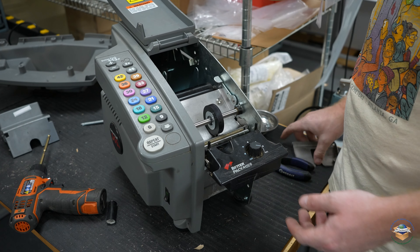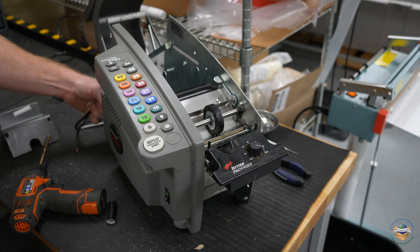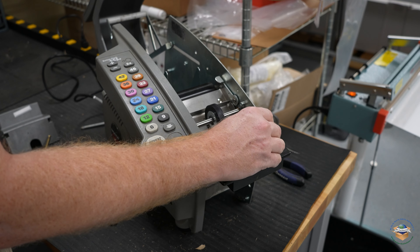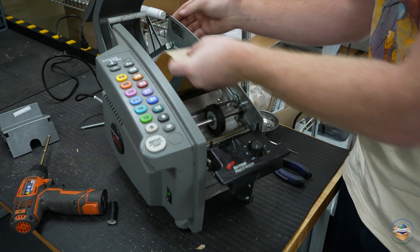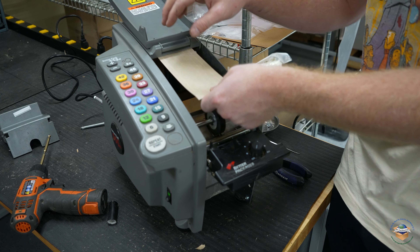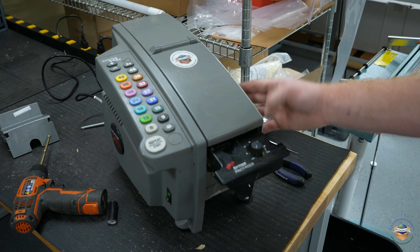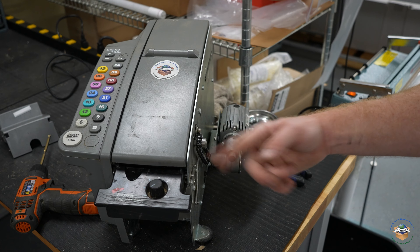We are now finally to the point where we can put in our upper tape plate, plug the machine in, and check if this heater works — and it does, great. So we're going to turn it off because we don't really need it on during repairs. I'm going to drop a roll of tape in. Make sure you're feeding around this white roller — if your operators aren't doing that it can lead to issues. Feed that tape through and be mindful we don't have this other side on yet, and there's a motor chain right here, so just watch out for that.